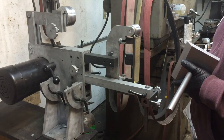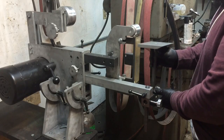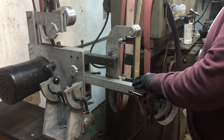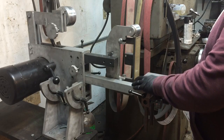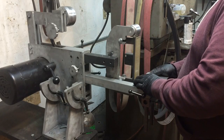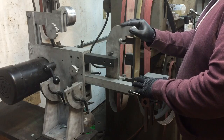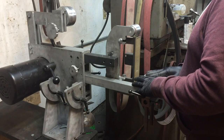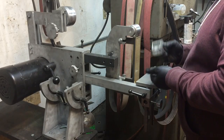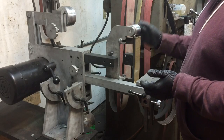We'll go ahead and pop that in — this will probably be the most common setup. The way this is set up, you're going to hit 90 degrees from your sides every time. Whether you're 90 to the face of the platen depends on if you've zeroed your platen from the beginning, and that's pretty easily done with an angle cube — just zeroed on the table, then pivot this to 90 and it'll be perfect every time.